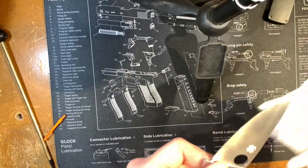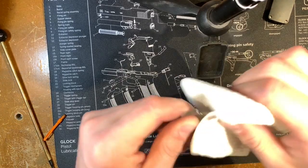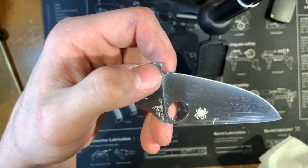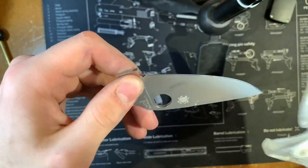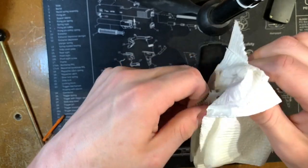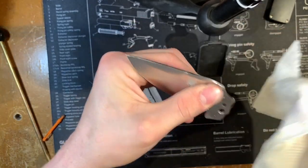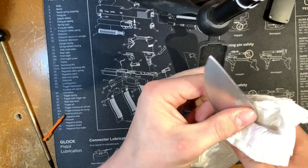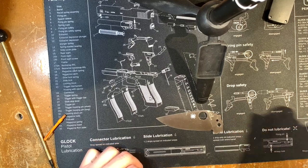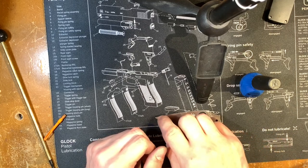So the next step is going to be using the ferric chloride to acid etch the blade. We're not going to be doing an acid stone wash, but we are just going to be etching it today. To do this, you're going to need some rubbing alcohol of any grade, some nail polish, your ferric chloride, and a container to hold your ferric chloride in. Right now what I'm doing, I'm just using that rubbing alcohol to clean off the blade — make sure I got all that sharpie and everything off where the nail polish and the ferric chloride won't have an easy time sticking. Once I feel like I've gotten everything off of this, I'm going to go ahead and set it down to dry for a second. And now we're going to figure out exactly where I need the nail polish to go so that I don't mess up the pivot, so the blade still opens smoothly, and so I don't have to resharpen it in this case.